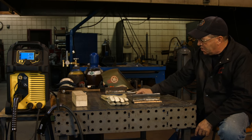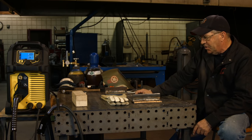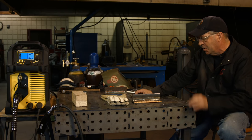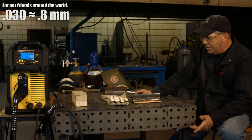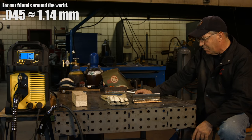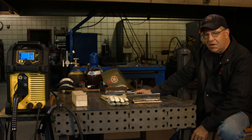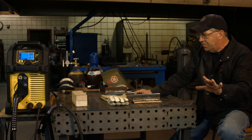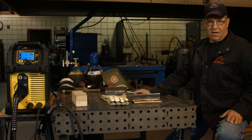Anyway, good machine, good arc features. I noticed a little bit in an output setting — I don't know if it's an issue, I'll have to run a bunch more and go through some ranges to see what's happening. But again, we can run .023 wire on sheet metal, .030, full range of .035, and you can spray on anything even the .045. We haven't even run flux core yet — so maybe that's our next video. I hope this helps. Thanks for watching Weld.com — make sure you subscribe, new videos come out every Monday. Thank you.